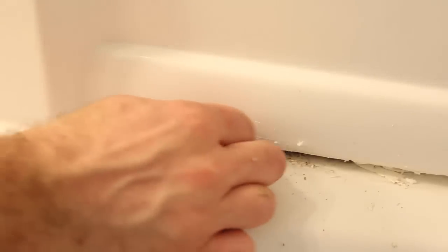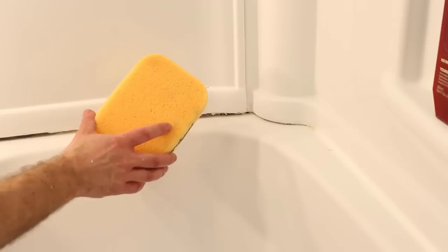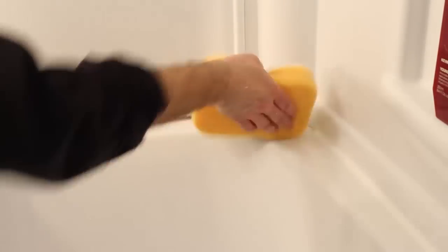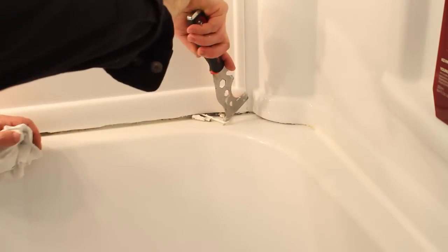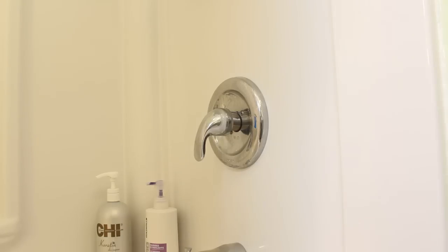Groove the bottom out, groove the top out, and then you'll be able to remove most of the old material. Make sure you remove all of the old caulk from the bathtub — it's going to fall into the bathtub. Then use a grouting sponge to abrade the tub surround and the tub itself. I like grouting sponges because they're just mildly abrasive. Then take a rag and wipe off the surface the best that you can, and make sure that it's dry. If you notice any old caulk, you have to remove it — you have to be very diligent about this. The surface has to be clean and dry for the new caulk to adhere.